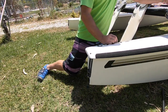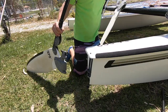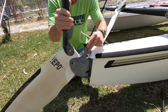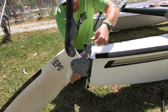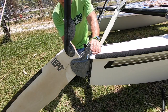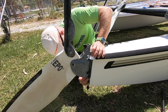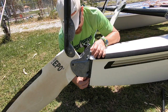The ideal thing is to service your rudders as you put them on, but if you're putting them on and off a lot or haven't got the time, just put them straight on. Take the rudder stock with the rudder pin and line that up — if you've got a slightly older boat, your system might be slightly different — then insert the pin from the top. If it's a little bit tight, giving it a wiggle will help you get it in. Very important: put a split ring into the bottom of that rudder pin to make sure the rudder doesn't fall off when you're upside down.